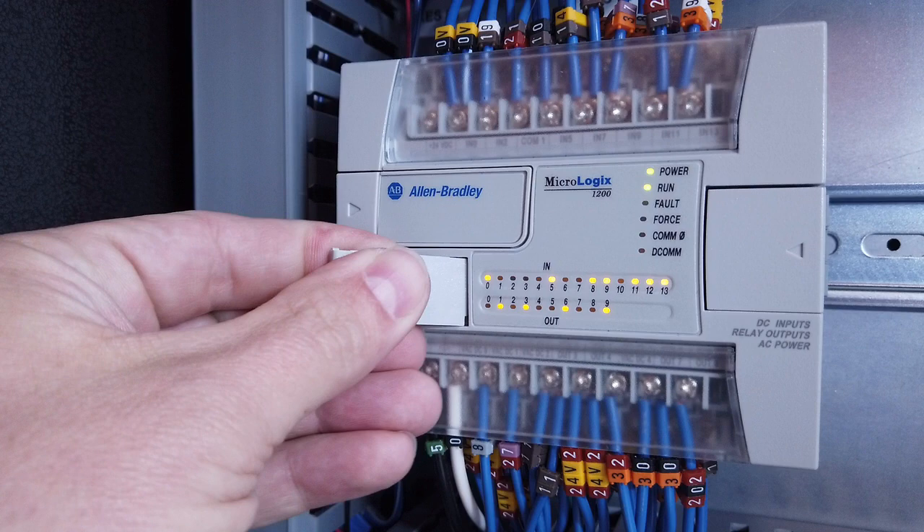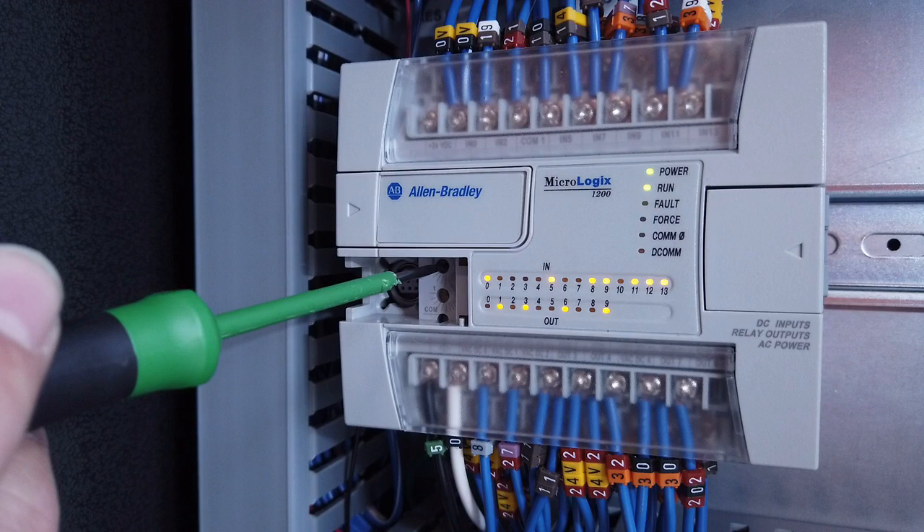Because these photo-eyes do not have any built-in delay, Woof-Tech will then use the PLC trim pot zero as the photo-eye delay adjustment. But that's only available on machines equipped with the standard control panels. If a basic control panel is used, an external time delay relay will need to be added to the carriage to achieve the same result.